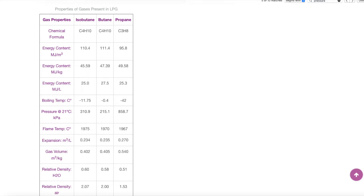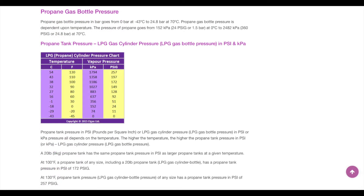We'll quickly talk about propane, butane, and gas pressure. On this chart you can see propane is 858 kilopascals at 21 degrees Celsius, which is four times the pressure of butane. Add to that another 400 kilopascals on a hot day of 40 degrees Celsius — which we have every summer here in Australia — and you've got bigger problems. Links to these and other documents will be in the video description.